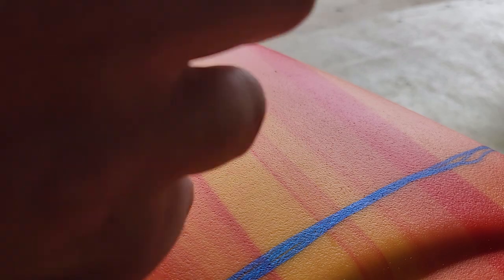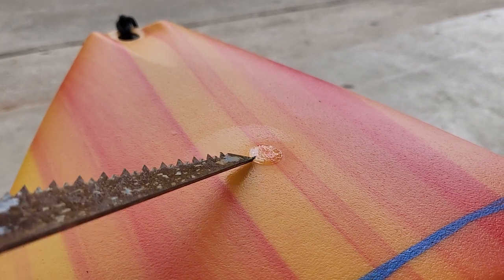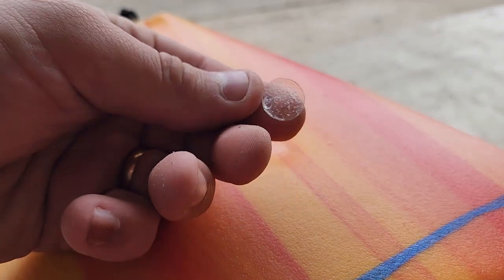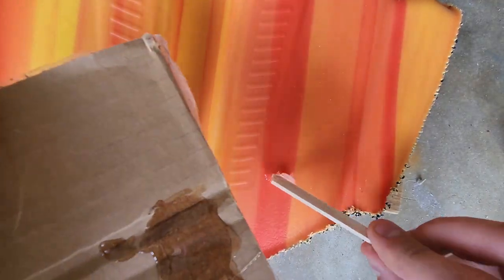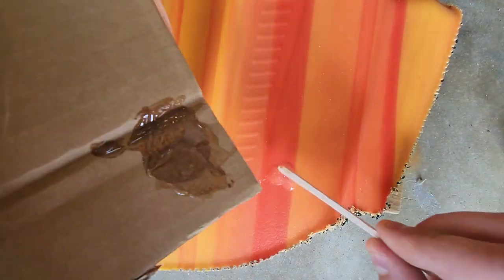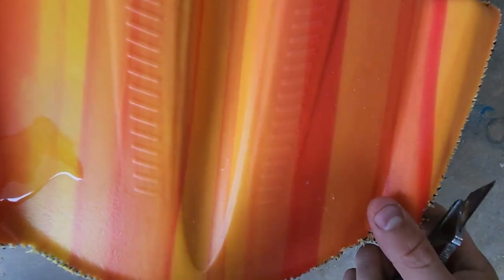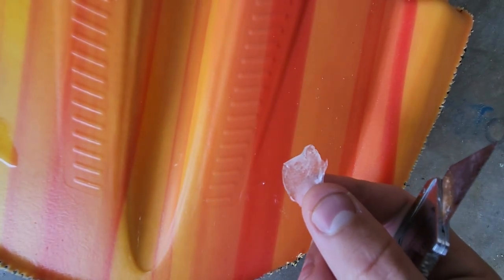After a little research, I discovered that Ram-X is just a marketing name for a variation of high density polyethylene. HDPE is waterproof and doesn't corrode — it's all around pretty chemically inert — but the same thing that makes it so inert also makes it difficult to bond to with adhesives. Here, I've put a bead of CA glue on the hull and hit it with accelerator. After it dries, I'm able to peel it clean off the surface with very little effort. Here's another demonstration, this time using two-part epoxy, and once again it peels clean off the surface of the polyethylene like nothing was ever there. So this is obviously really bad news if I want to do fiberglass work on the hull of the kayak.